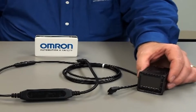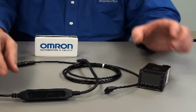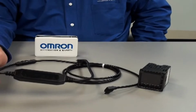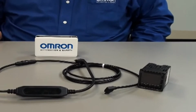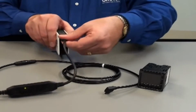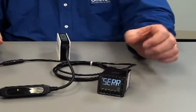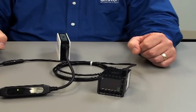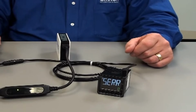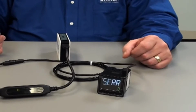The advanced easy to set up feature is the ability to power up the E5C family of temp controllers using the E58-CIFQ2 serial conversion cable and a USB power supply or USB port on a computer. Here I will be using a USB power supply to power up the E5CC temp controller by taking the conversion cable and plugging it into the E5CC temperature controller. This feature powers up the temperature controller without the hassle of input power wires to the unit. All that is required is the USB power supply of 5 volt DC and a current of 450 milliamps max.